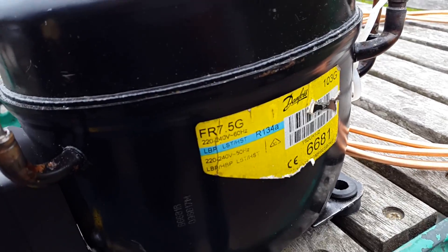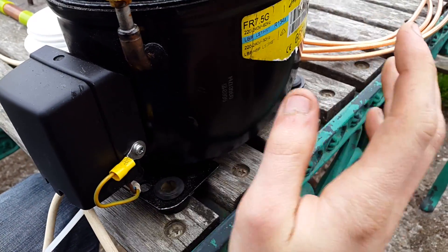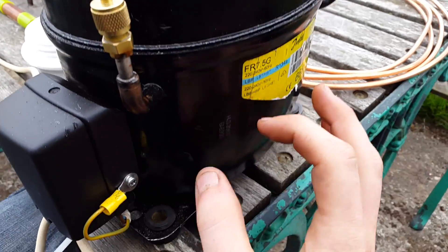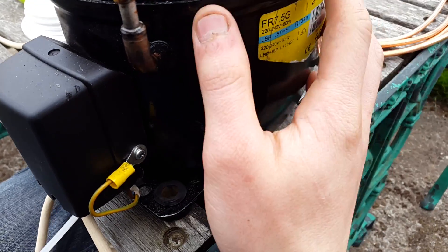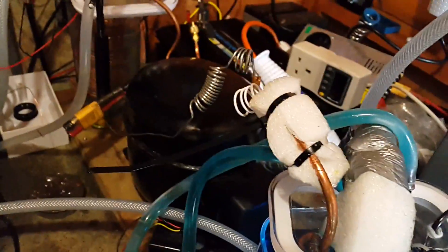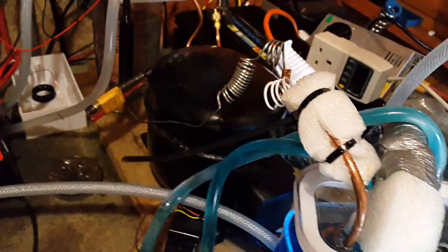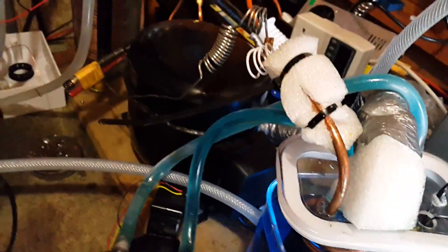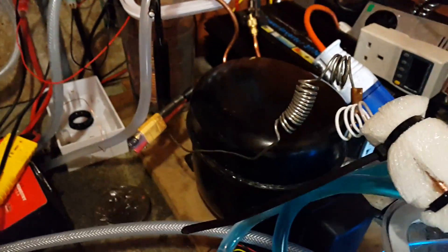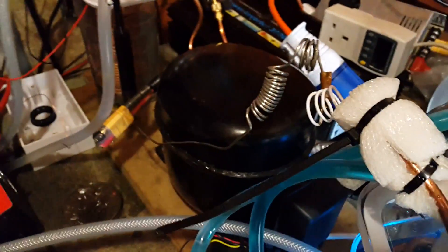The compressor that you use is not too critical — just use whatever you've got for the refrigerant you have. I'm actually using R290 which is propane, but it works okay in R134A compressors. This is an R600A compressor on my old system and I'm actually running propane instead, and it works brilliantly. The compressor doesn't overheat even when it is moving quite a bit of heat, and the discharge temperature does get really warm but it doesn't seem to be bothered by it at all.